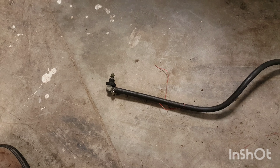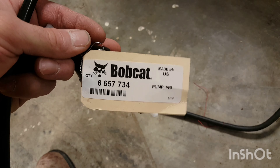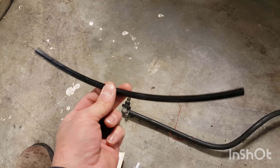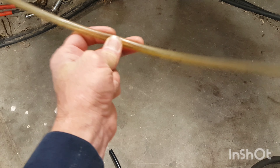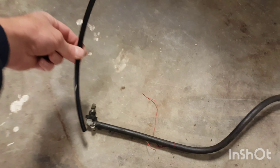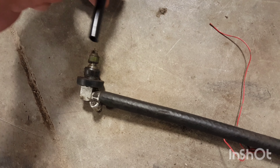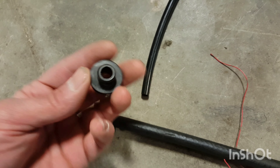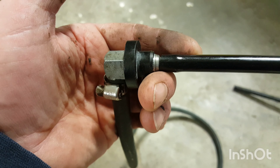There's the old line. I've already got the new parts — talked to Bobcat. There's a new bulb with the part number if you're interested. They give you this hard plastic tube now — I'm guessing the old tube was like that clear rubbery stuff used for tracer lines, but they're using hard plastic now. They never put a new 90 on it — they basically just cram the tube onto the existing 90 as best they can. Got the new rubber grommet too, so let's see if we can take the old stuff apart and get all the new parts back on.